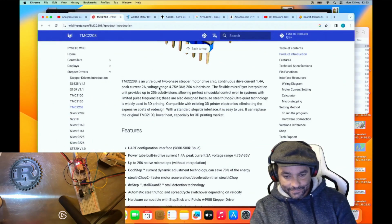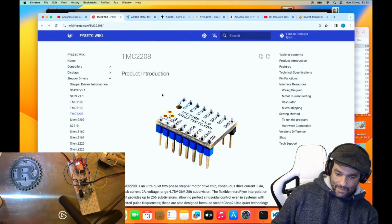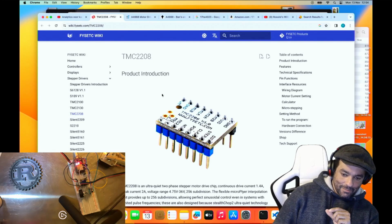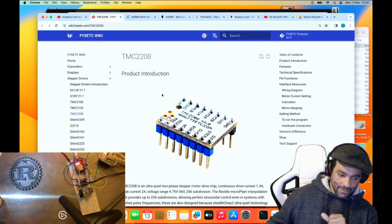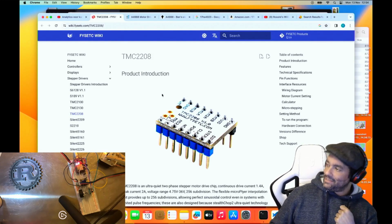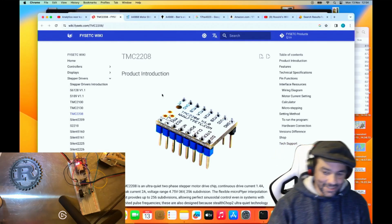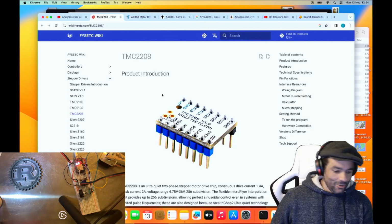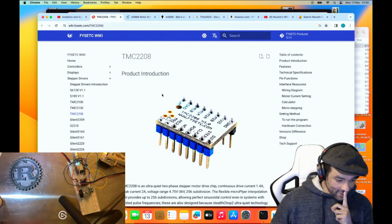And the one I'm having here is this one, TMC2208. This is a so-called silent stepper. They're called silent. I mean, the controllers are always silent, but a stepper motor basically works in pulses. So every time you pulse, the motor rotates a little bit. But if you think about it, that can be a pretty noisy thing. It's like turning your motor by hitting it with a hammer. It's really sharp, and you can look on YouTube for a stepper motor orchestra, because basically it's a speaker. If you pulse it at a certain frequency, that's what the sound will be.